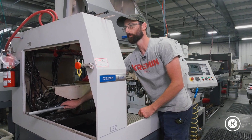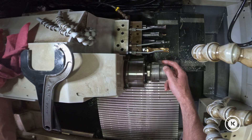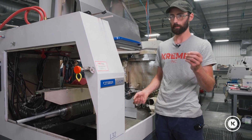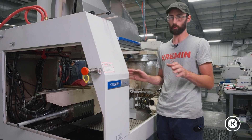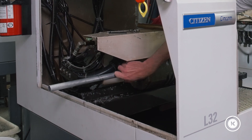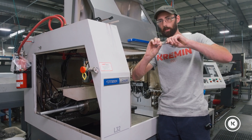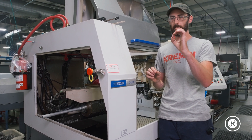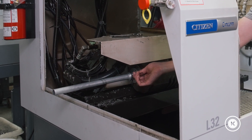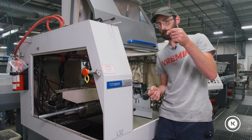So I just grab the tube, slide it forward until I feel it stop. Stick my finger in there and I can feel the tube — turn it a little bit, yep, that's the tube. You can make a sharpie mark if you need to. I just back it off an eighth to a quarter inch — something reasonable. You just don't want to back it off too far and you don't want to touch the back of the collet pads. Grab a wrench and just give it a scooch. Then we're going to tighten down those two grub screws just with our fingers — we're not going to crank on it because that's going to deform the tube wall and your parts may not go through. So we're just going to gently snug it down just until it's being held so it won't slip. Literally just two fingers, just a little bit.